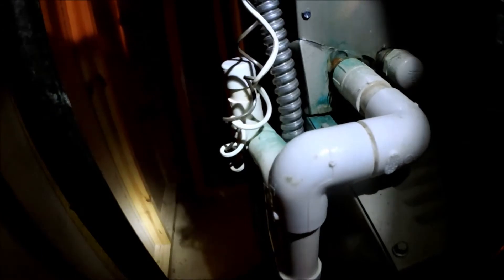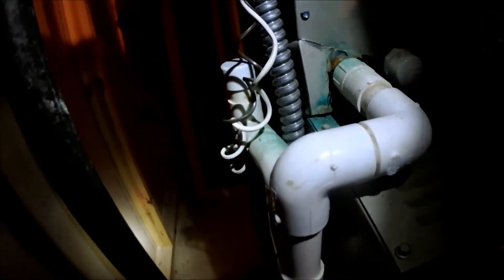The genius installer has put the clean out on the wrong side — should have been here, but they put it over there. Looks like this has happened before. See how the coil's bent? Someone bent the coil door to get into it, so I'm going to tell him he's got to re-pipe this trap so we don't have to get into the coil.